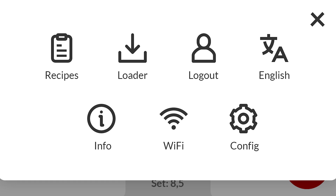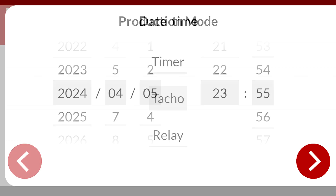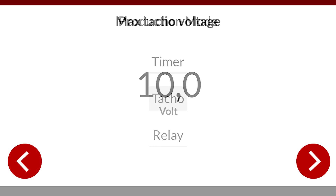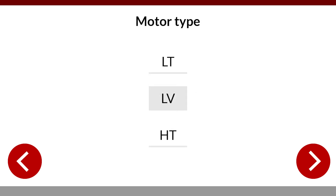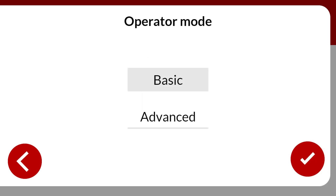Select your configuration. Adjust time and date. Select your production mode — for this example let's take tacho mode. Specify the extrusion synchronization tacho signal range. Select the type of motor connected. Then select your hopper loader type. Select your user level: advanced for all functionalities and basic for limited functionalities.